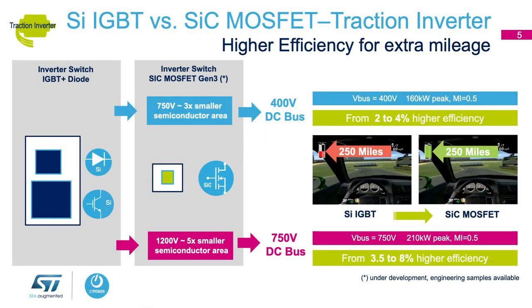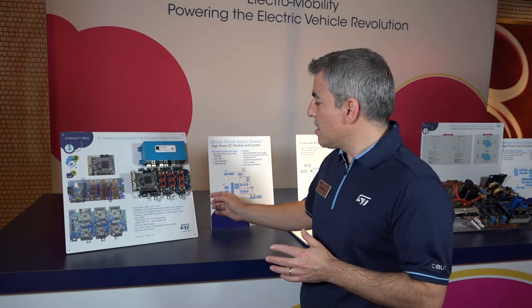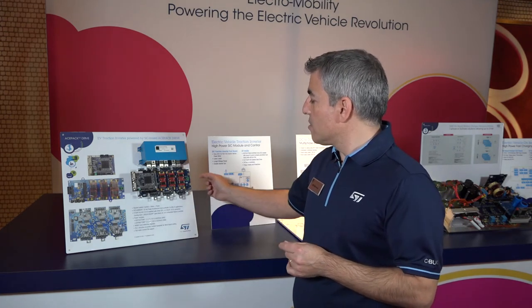The choice of using silicon carbide as a power switch in the module makes this solution very compact and very powerful — not achievable with silicon IGBT. We can achieve much more power and reduce power losses by at least 50 percent, which results in a 7 percent better increase in efficiency and better utilization of the battery. The system comes with firmware included, so the only thing you need to operate the motor is the water cooling jacket going through the water chamber and the DC link.